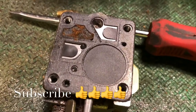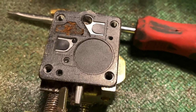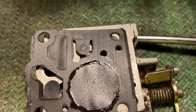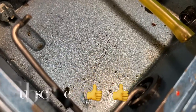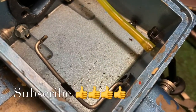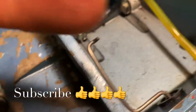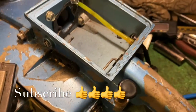Let me show you another one just so we can compare. This is one of the Zama carburetors. You see the sawdust there? We've got some dirt in here — it definitely sucked some dirt up. Let me pull that off and check the bottom side. That's how the gasket should look. It shouldn't be wet all around the edges. See how this one's wet all around the edges? I was looking and the camera's not picking up on it, but that's actually wet down there — it was leaking fuel right inside there. It looks like an air leak in the carburetor itself.